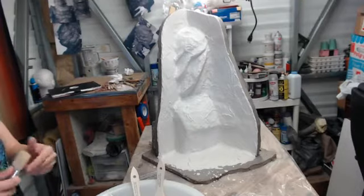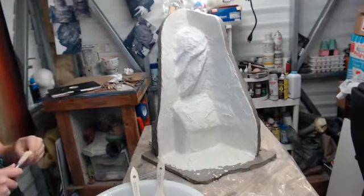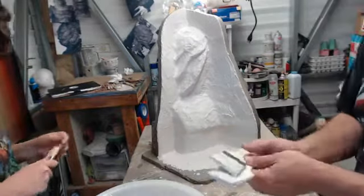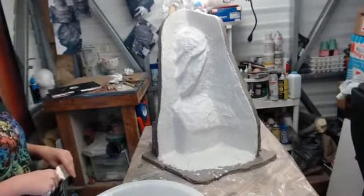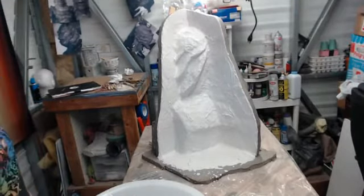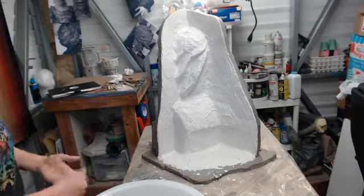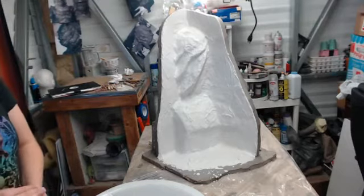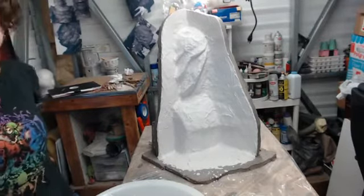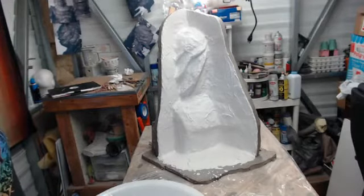And you can rinse brushes when you're doing this and get all the material out, but I would not use them. I would let them dry before you reuse them because of that waterlogged issue. See, these are getting there. And I also wouldn't use them on a print coat. If you have to reuse the brushes, rinse them out, get them as clean as you can, and then use them on third coats and ups, because they can get a little crunchy.